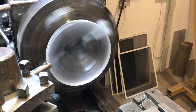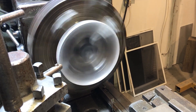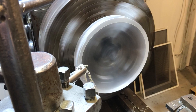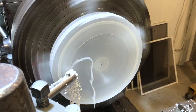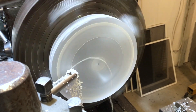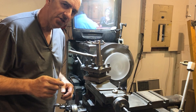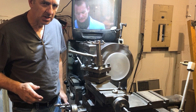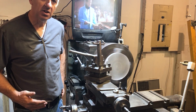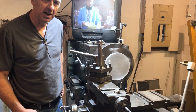I'm just going to start machining it now. It's going to be very, very messy — that's the downside to machining this stuff. It machines really nice though; there's no problem machining this compared to acrylic, that's for sure. I'm taking off the heavier cuts here, still being careful not to raise the temperature of the material, because heat is your enemy when you're machining a submarine port. I've got 30 thousandths to go, so that's the maximum I want to take off in one pass. After this I'll just give it a quick sand with 1500 grit paper and maybe a little polish, and then it'll be ready to go in the chamber.